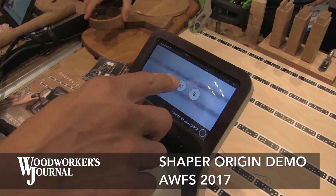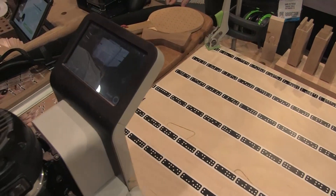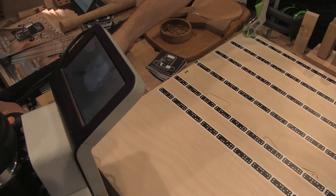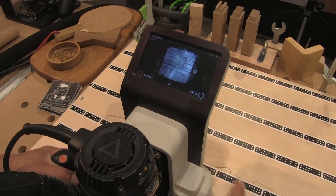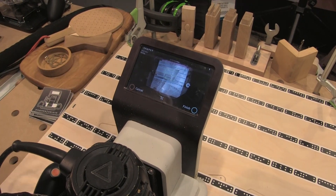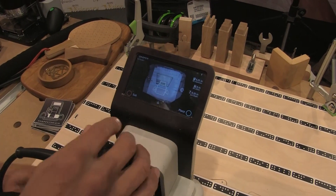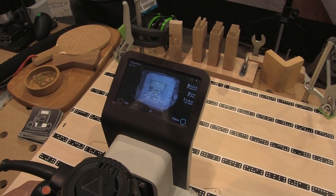Here I'm going to show you how we scan a new workpiece — really simple operation. We've got a downward facing camera and we're looking for the tape, so we're basically just running this over our workpiece. Press finish and it's saving. What's happening here is it's stitching together all the images that the camera just took and it builds them into a big composite map of the workpiece — really similar to taking a panorama photo and stitching images together to make one big photo.